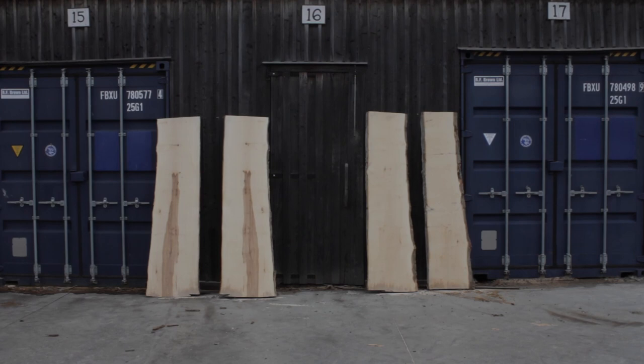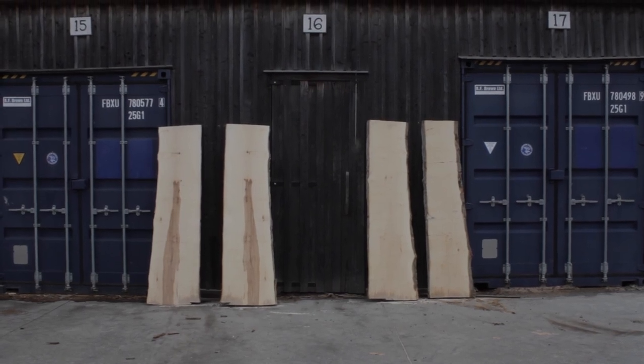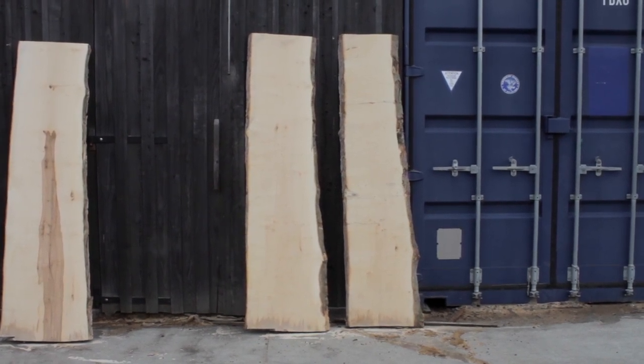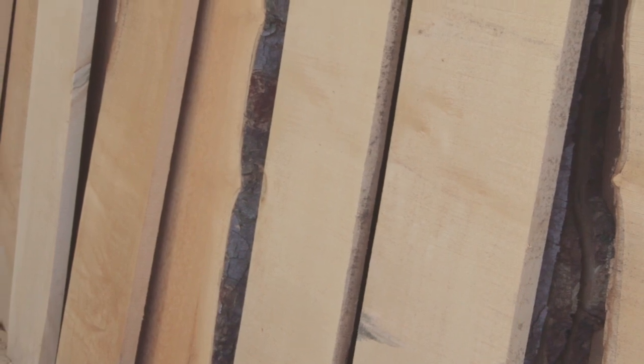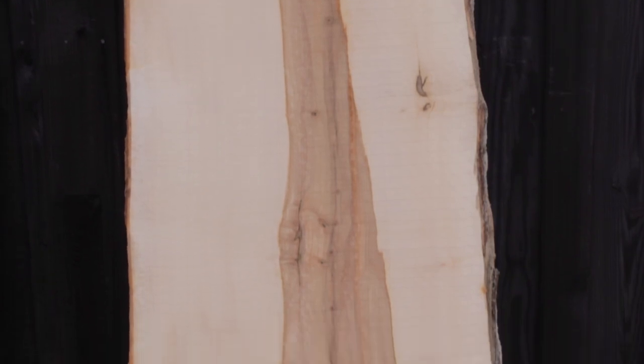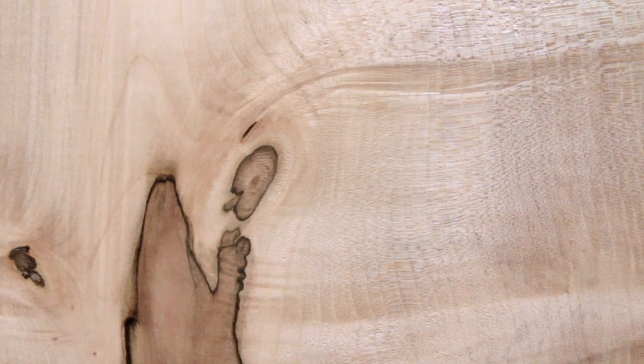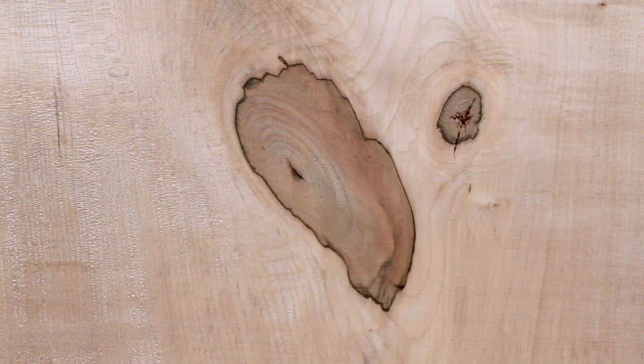Sycamore is a beautiful timber and it has a wide range of uses. Here we see some fresh sawn boards, and you can see that typical lovely creamy white that you get with sycamore. The colour in sycamore tends to be quite uniform across the width of a board, with the sapwood indistinguishable from the heartwood, unlike most other homegrown timbers. As the timber ages, it will lose this creamy whiteness and take on a darker hue. In bigger and older trees, you often get this colouring in the centre of the log — something that the mainstream industry would normally discard, but something we love to see here at Scottish Wood. Often you get a bit of spalting in this darkened centre, and this can lead to some stunning colour, contrast and effect. These would probably be some of our most popular boards here at Scottish Wood.